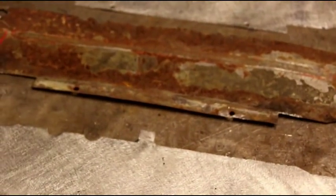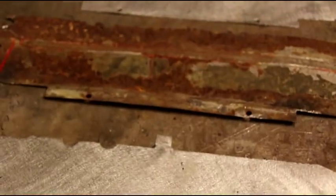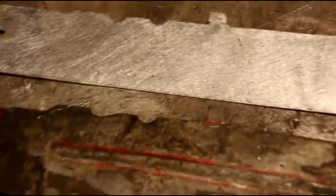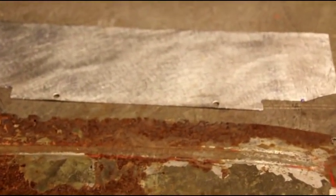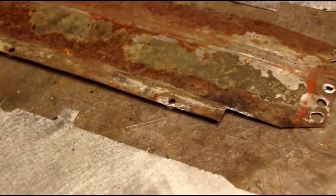And I think just a little while ago I told you this was 26 gauge. That's a mistake. I was building some ductwork for a furnace that was 26 gauge. I got a little confused there. This is actually 31 thousandths, and works out to be 22 gauge. So I've got some 22 gauge here. And that's what this was made out of originally, not the 26 like I said earlier. Just get my projects mixed up here. But this is a little bit heavier stuff, 22 gauge, but no problem at all. We could still bend and shape that easily. It's no big deal. So I will continue on cutting out the side blanks, and we'll get putting this thing together.